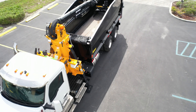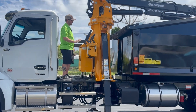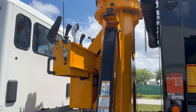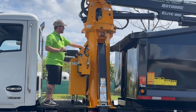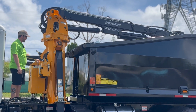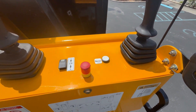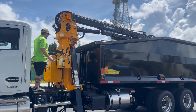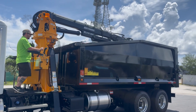With our outriggers down, we have these right here as well. This is a sensor arm that is designed to let the loader know when you are operating inside the walkway. When you have this lifted up, you have no controls on the joysticks. In case of any emergencies, you have a red emergency stop. Both the emergency stop and the arm handle run on the same safety circuit to eliminate the joysticks. With both arms down and both emergency handles released, we have full operation of our joysticks.